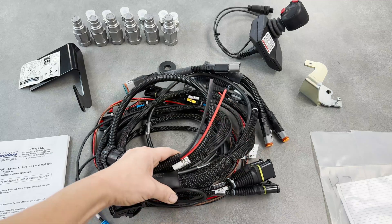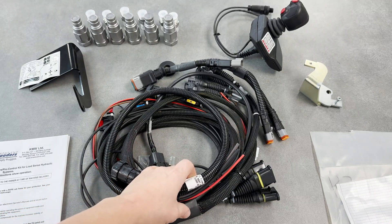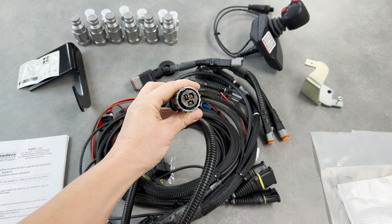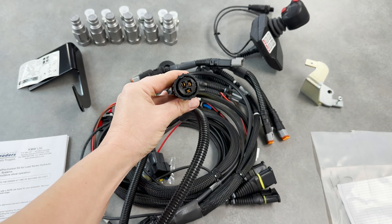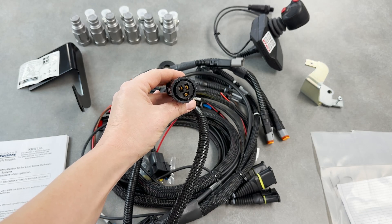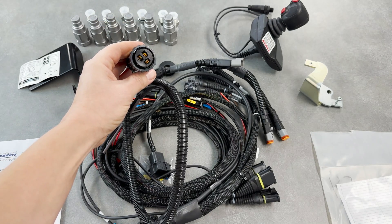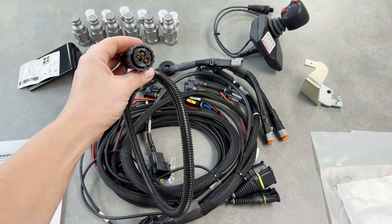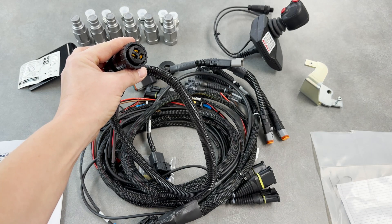This is the wiring harness which as you can see is quite extensive. In this video I'm not going to go into the specifics of how to attach the wiring harness to the control valve and the joystick. I'm only going to point out this bit of the wiring harness. This is your universal female three-pin AMP power connector and it's designed to plug into the auxiliary plug in your tractor cab. If you don't have that we do provide a male side to this as well if you need to wire it in. The important part is that this is where all the power for controlling this mid-mount control valve comes from. The joystick is external to the electronics of the tractor — it just needs a power source and everything else is built into the joystick kit itself.